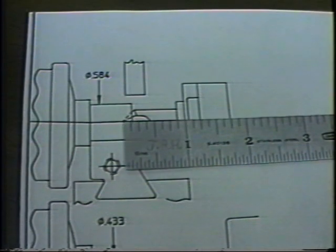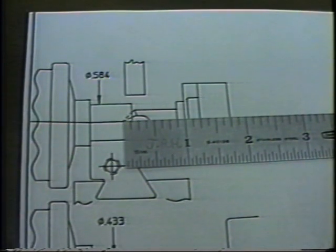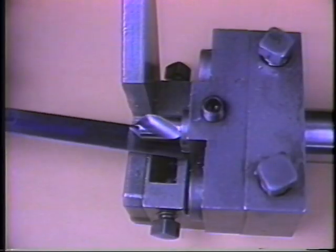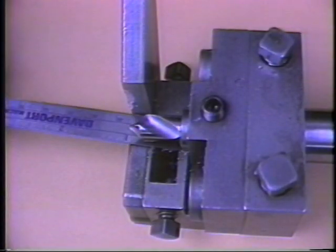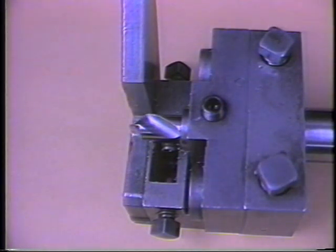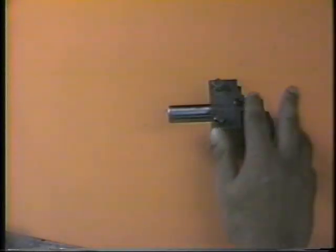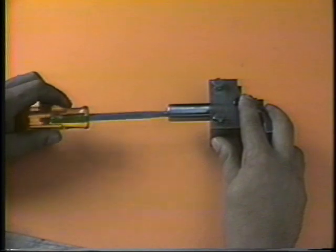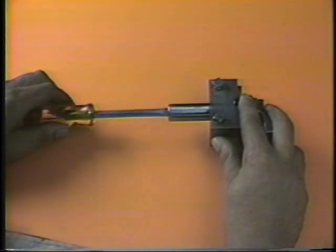On the workpiece layout, we see a center drill in the first position protruding 7/8 inch from the base of the holder. Place the drill and drill bushing in the holder and position to the scaled dimension. Secure the drill in place by tightening the 836-12-8 set screw. Adjust the screw in the shank of the holder until it seats on the back of the drill.